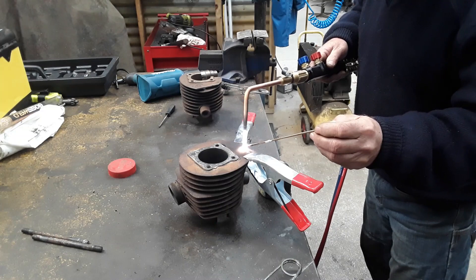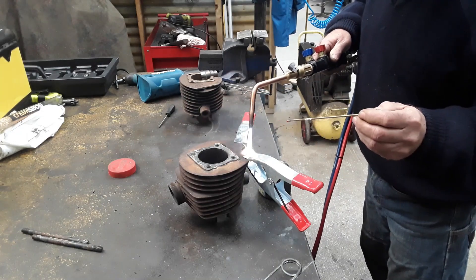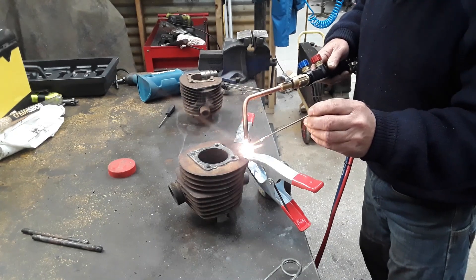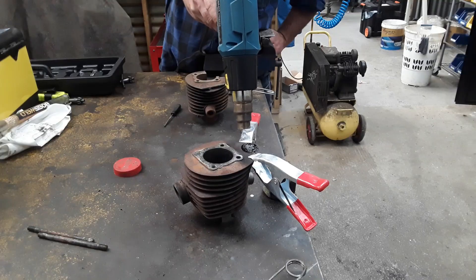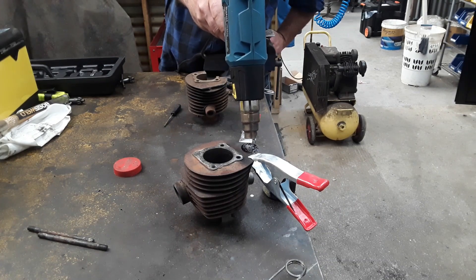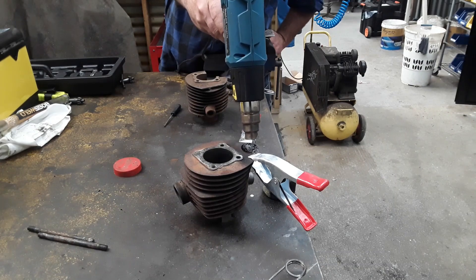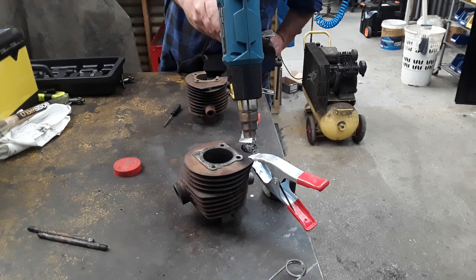Bit too much flux on that. It's just getting a fraction too much heat. What Justin's doing there is just maintaining some heat in it while it cools down. It's not working the way I wanted it to — there's a fair bit of crap coming out of the material. So what I'm going to do is take it away from here and bead blast all the surfaces. Probably sand down a bit more, giving myself a clean surface. I really wanted the bronze to go into the groove but it just doesn't seem to be taking it — seems to be picking up crap and putting it into the weld pool.